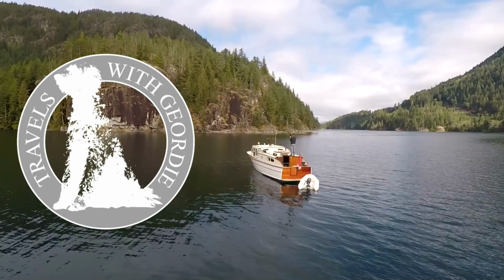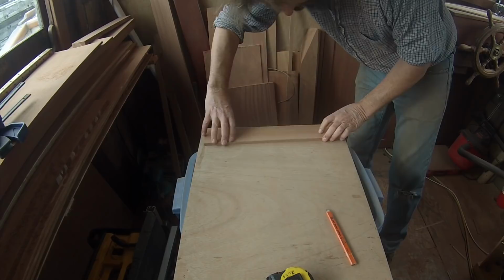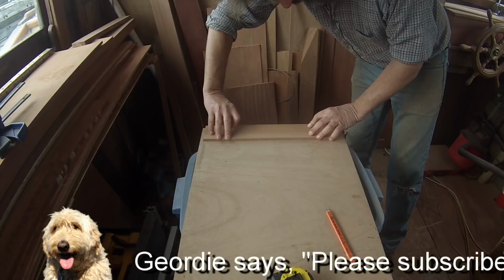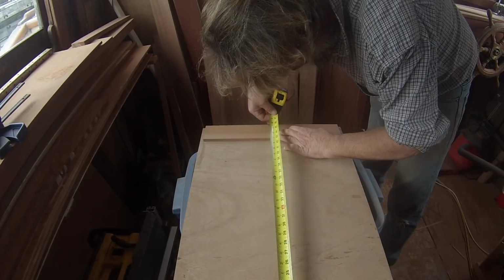Okay, this is gonna be a little curved pediment piece to go on the top because I tend to do that on just about everything. So I'm just gonna use my old trick of using a tape measure to create a large arc. I'm just going to take advantage of the table being 4 feet long, put a center line on this end, put a center line on the other end, although it doesn't need to be so accurate down there, and just scribe an arc. There we go. See what I think of that.